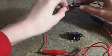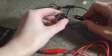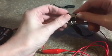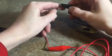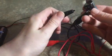You just want the switch here — unclip this one. So that's from the battery pack, and then this one is attached to the motor. You just want to put this really anywhere you want — I'm going to put mine right here. Nothing happens because we've not completed the circuit. Then we have this extra one that we brought over — clip that back onto here. It's sort of messy; if you get a tangle, just make sure you organize it. You don't want to clip these onto the wrong ones.